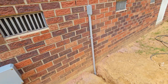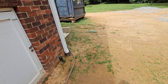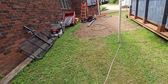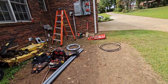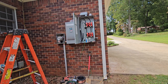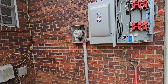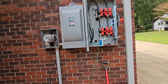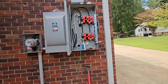I had to get a building and electrical permit, a North Carolina Utility Commission docket, and I had to submit my plans to Duke Energy for an interconnect agreement, because once this is all done they're going to come out and put a bi-directional meter in. All of that took quite a while, and once I got all those approvals we started the electrical work.